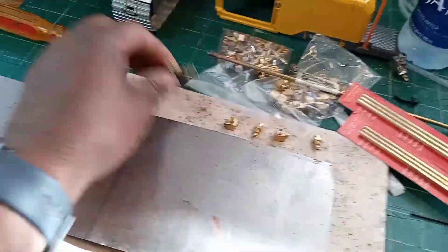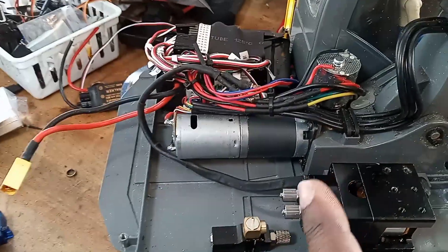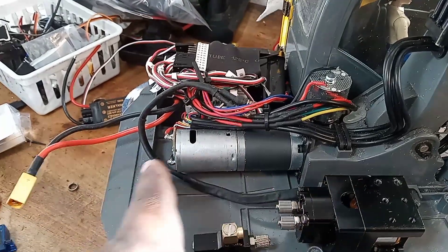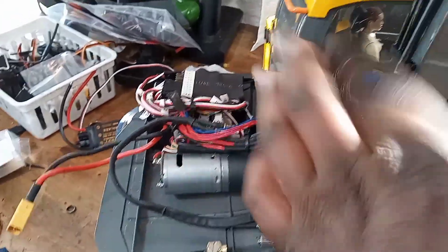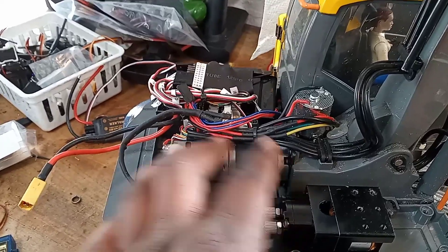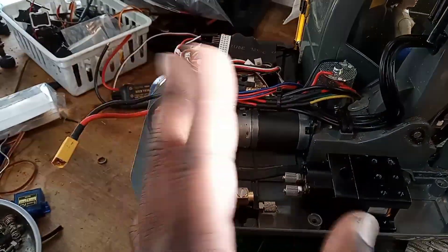What I'm planning to do is have the bypass valve set up with a line coming from the pump to the valves. I'm going to take out this piece right here that controls the boom — that won't be needed anymore. This gear motor is going to come out too, but it's a good gear motor so I'll repurpose it. I'm good at repurposing parts.